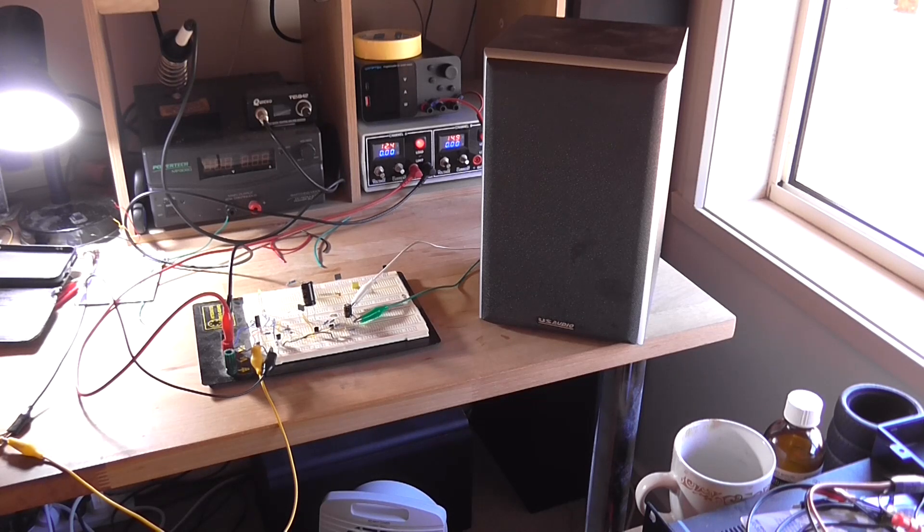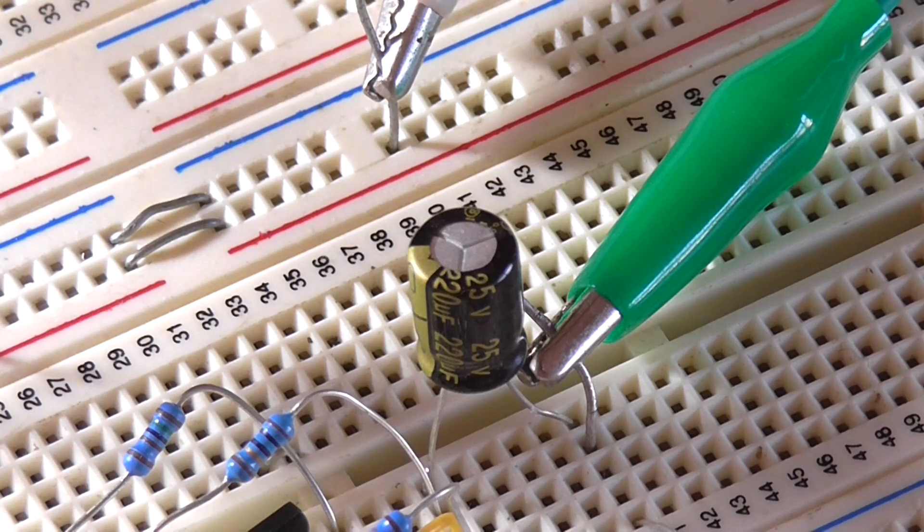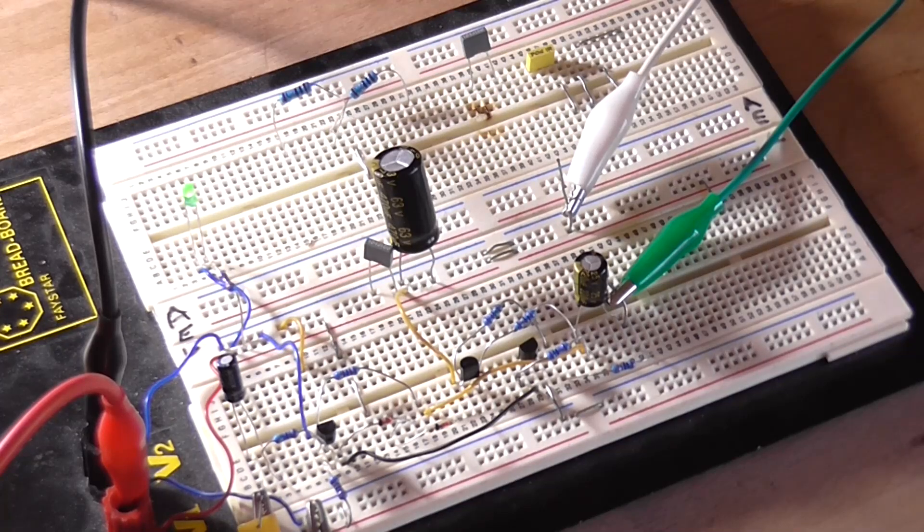That's enough of that — it does work, but there is a slight lack of bass, which is only due to the output capacitor being only 220 microfarad. The circuit does produce a broad range of frequencies, so it's good as a general purpose amplifier. That said, I'm not going to make a PCB for this — I don't really see the need for another 200 milliwatt amplifier. I've got plenty of them and have no use for them. But if anyone is interested in having a PCB made for this, let me know in the comments and I may route one and release it on PCBWay.